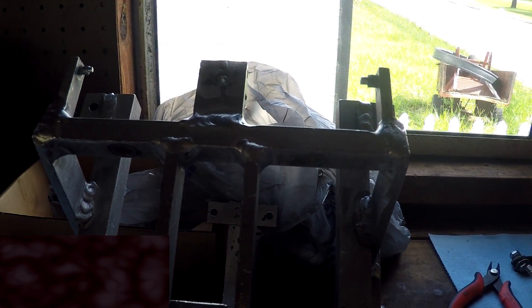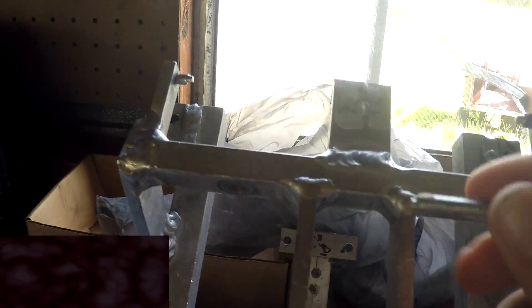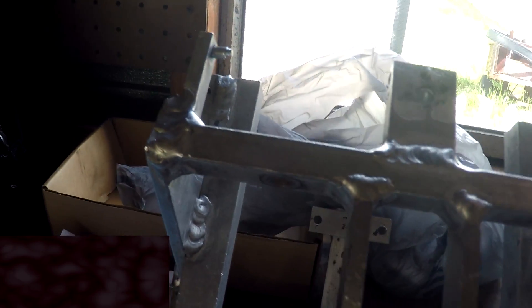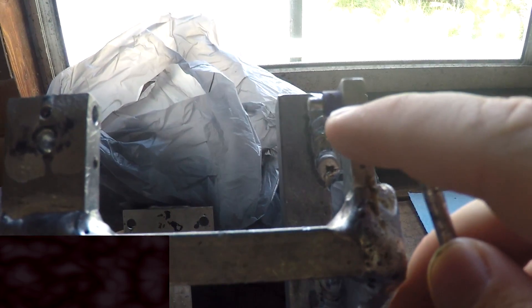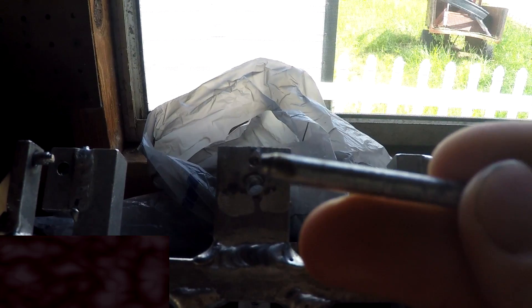I tore it all apart and degreased it, but I didn't put it back together yet because on the eyelids there's an aluminum rod that slides in between here and it has these aluminum rod tabs. As you can see, the aluminum has worn away quite a bit, especially on this right eye — same on the rod. The other side isn't that bad for some reason. So on Amazon I bought a new 3/16th aluminum rod and I'm waiting for that to come in so I can put a new rod in the center to reduce the play.